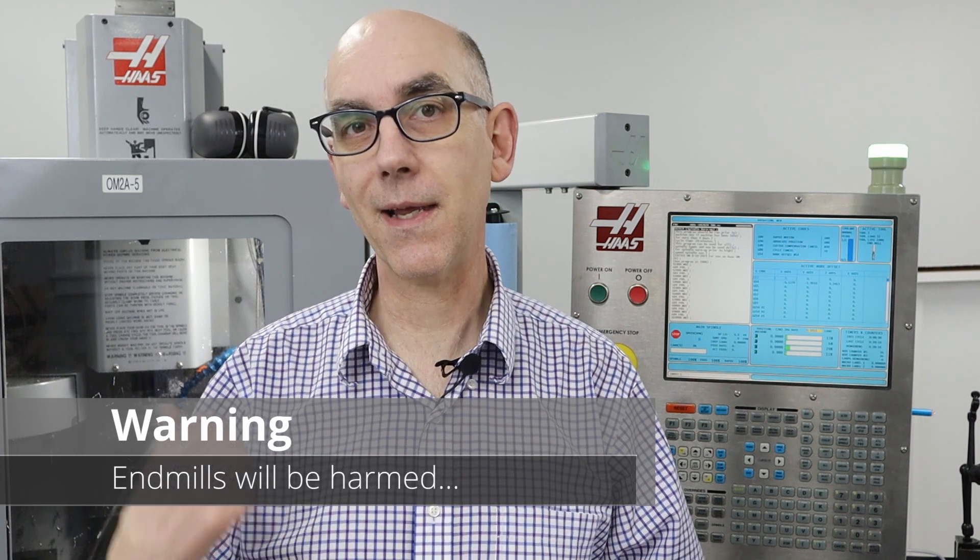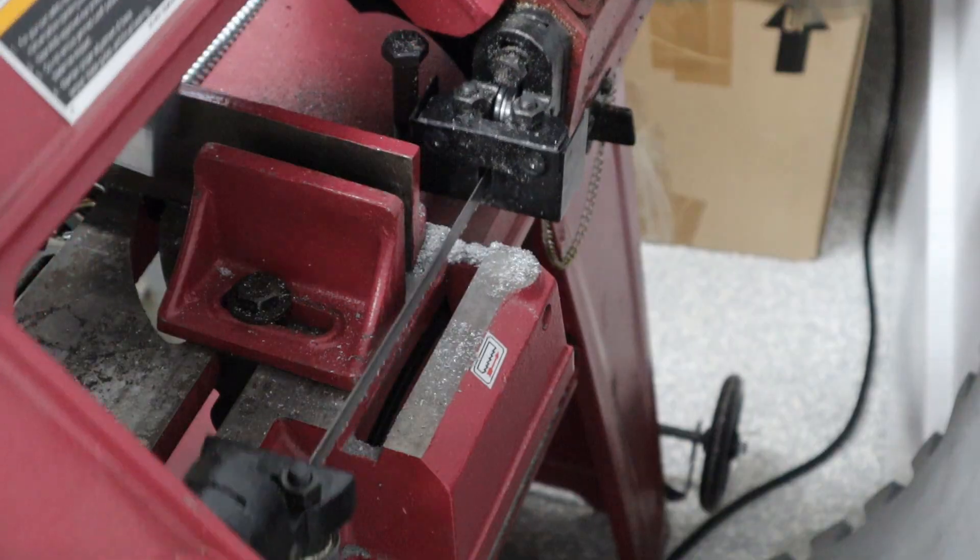The first thing I did is I got some material that was three-quarters of an inch thick by one inch. This part is 0.625 inches thick, and when I cut the part and put it in the vise, I thought it looked kind of low and there might be an issue. I measured it and discovered it was sitting down about 0.15 inches from the top of the vise, so I didn't have clearance to mill all the way around the part. I got distracted, and for some reason I pressed the cycle start button. Let's take a look at what happened.